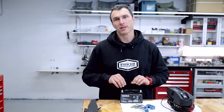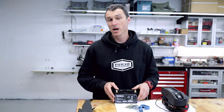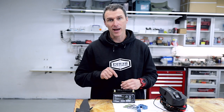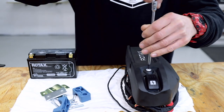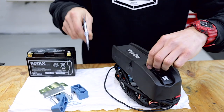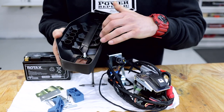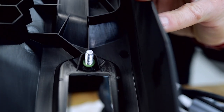We have already pre-filled the battery with the acid and charged it overnight so it's at full charge — we've covered this in the other video series as well, so you can click on that link in the description below. Just with a four millimeter T-bar, remove this screw and the battery cover just comes off like that. It's kept in here with a little O-ring and that just stops the bolt from falling out when you take the cover off.